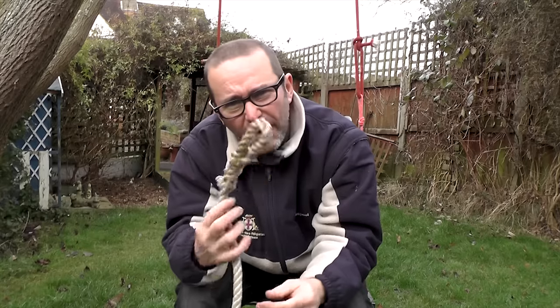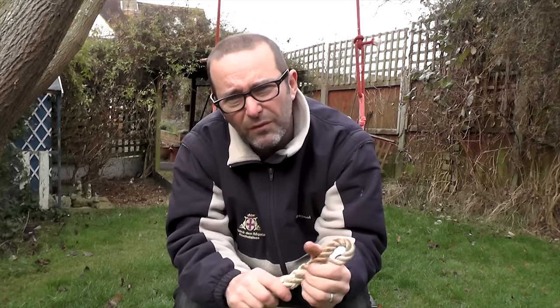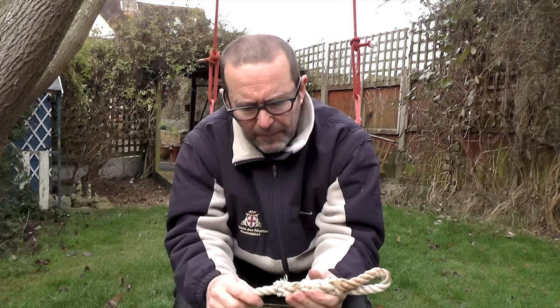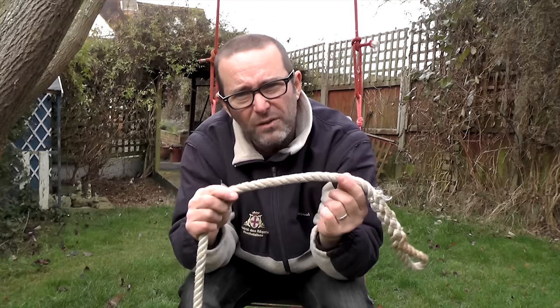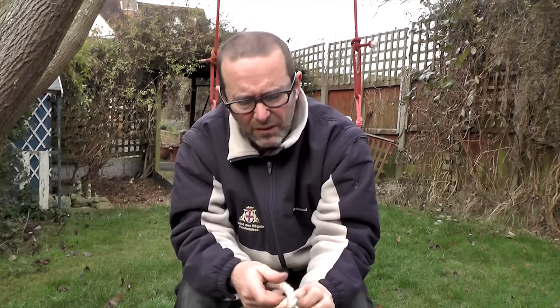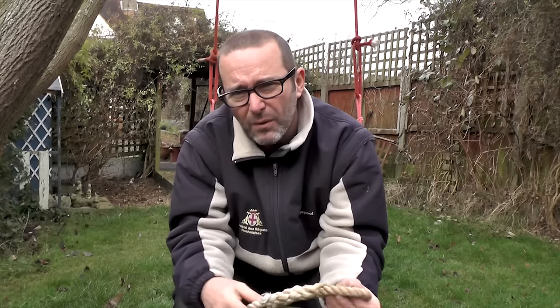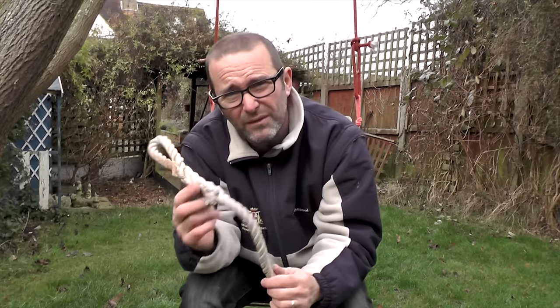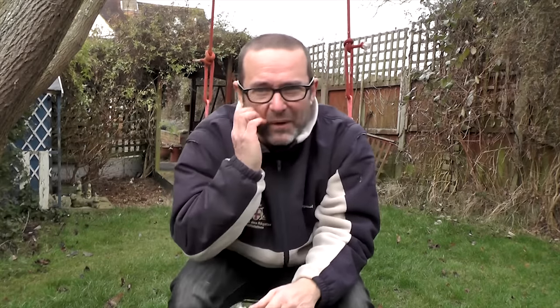I'm not going to tell you how to splice — there are plenty of YouTube films on that — but it isn't that hard. Don't let it put you off just because you haven't done it before. Watch a few videos and do it on a new bit of rope first. Don't try doing it on used rope, because used rope has been pulled tighter and tighter and lifting the turns to thread underneath is really hard work. On new rope it's nice and easy. It's a bit unnerving the first time you leave your boat on a splice you've done yourself, but honestly — if it looks like a splice, it's a splice and it'll work.